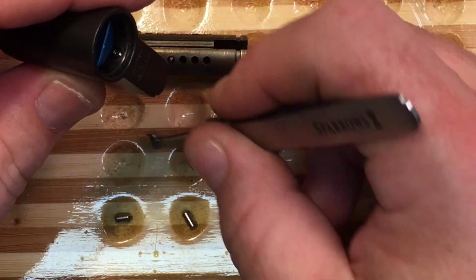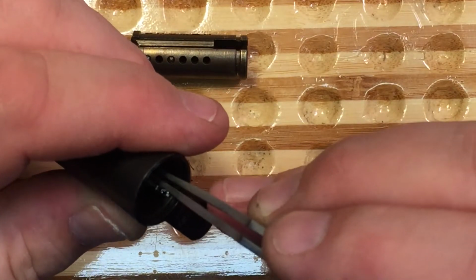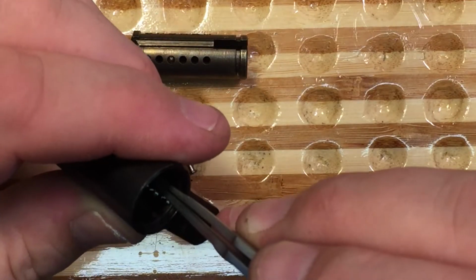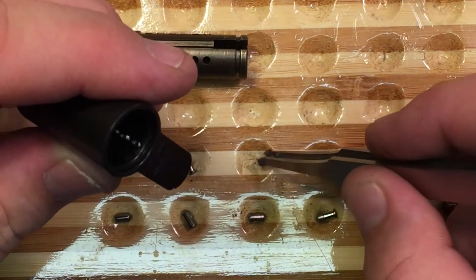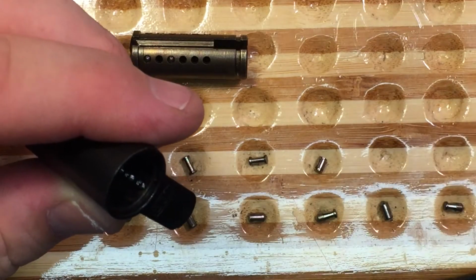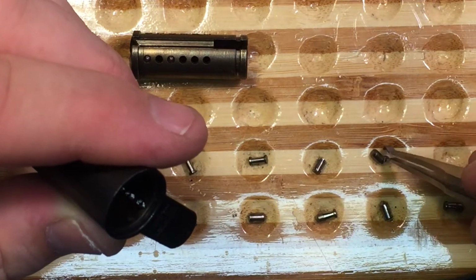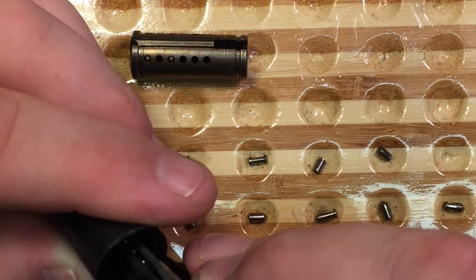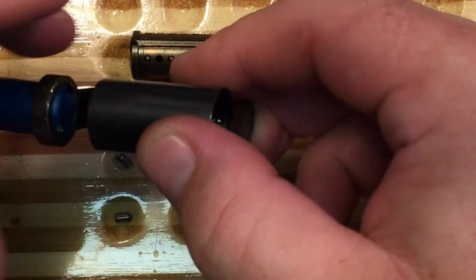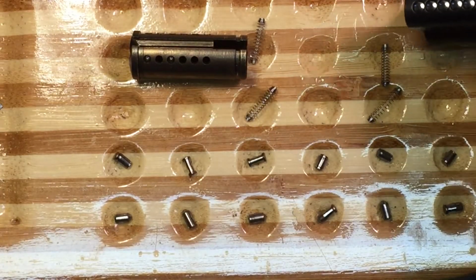Position 1 looks like an ASSA, almost like an ASSA pin, but it's not. It's a little bit smaller lips. 2 is a spool. 3 launched. 3 is also a spool. 4 is another ASSA pin looking thing. Dom's take on an ASSA pin. 5 is another ASSA pin. And 6 is yet another ASSA pin. So we got a lot of ASSA pins and a couple of spools.